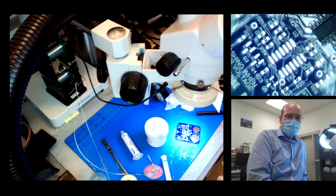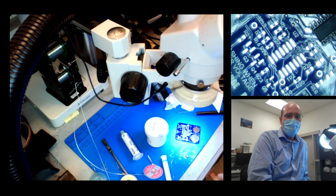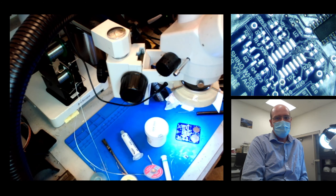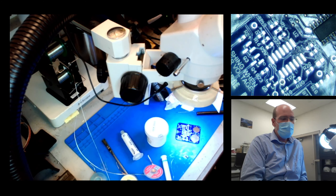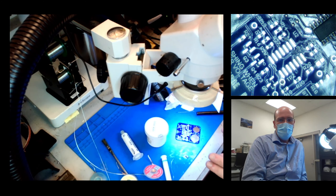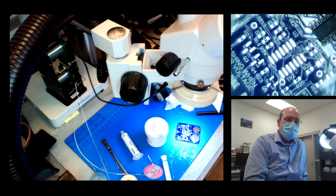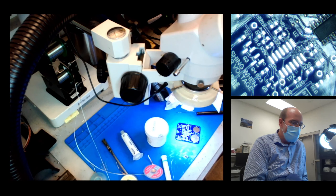This video is about manual soldering with solder paste. This is one of my favorite ways to do soldering — it's a quick way to get the general amount of solder you need on the locations you need it, and then it lets you do your magic with the soldering iron. Especially for redoing parts of a board, doing a small region, or populating a board piece by piece, soldering with paste and a manual iron is one of my favorite ways to do it.